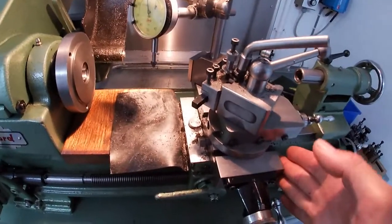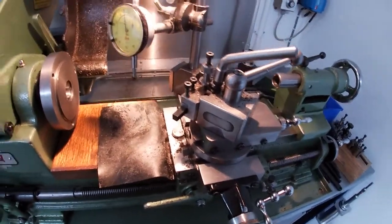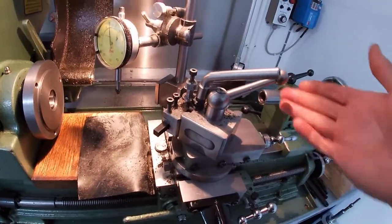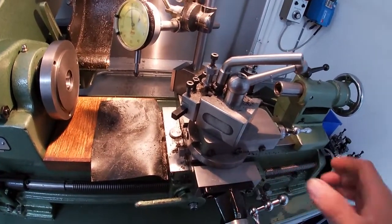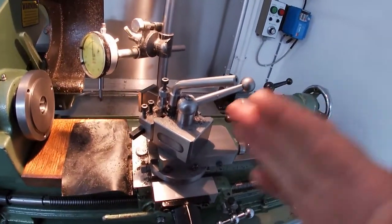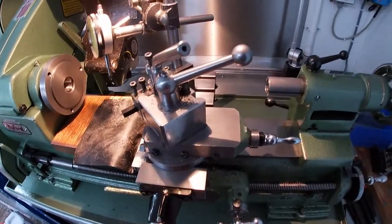So I've been through and set up the cross slide with the DTI on the bed and adjusted all of the screws on the gib strip so that there's not any play in there. There's always deflection in the metal and when you move the part it moves a little bit, but it's a case of finding where that point is and just allowing a small degree of play. I went through the gib strip and adjusted these at a single point all the way along the bed as I moved along.